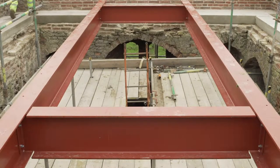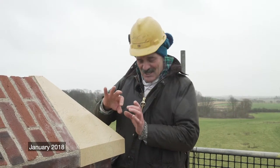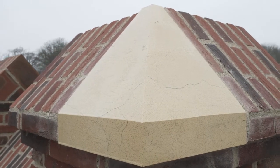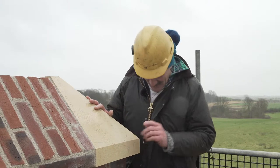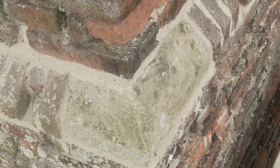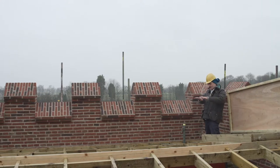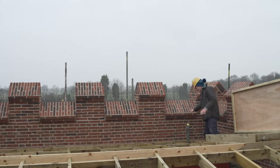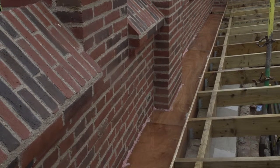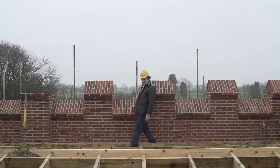One of the details we were having problems with is what happened to the brickwork on this corner — we didn't want to cut little tiny pieces and stick them in. So we came up with this lovely piece of stone, and each corner has this beautiful piece of stone. This is the exact same problem they had 600 years ago, and they solved it exactly the same way. Down below is the hatch — the staircase below gets us onto the roof. The roof drains gently to either side into these big gutters around the outside. I'm not particularly happy that these gutters haven't got their metal sheets on them yet, because that means the ply is exposed to the weather, and that's never a good thing.